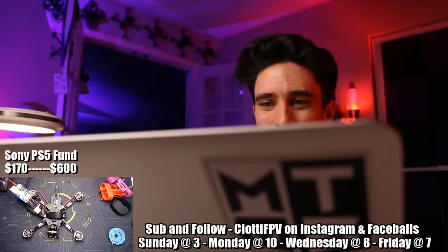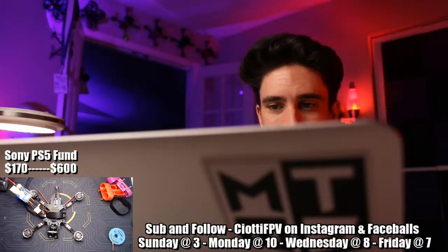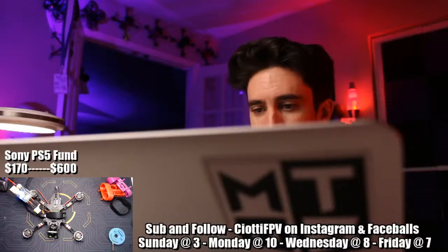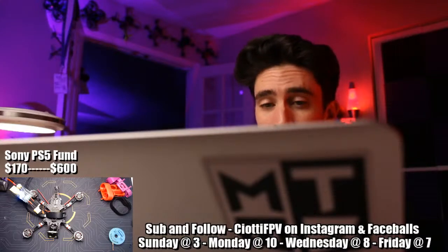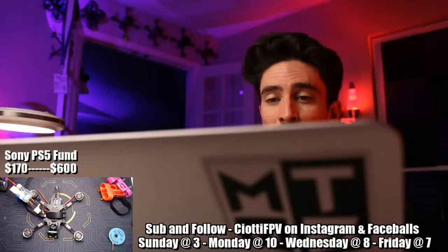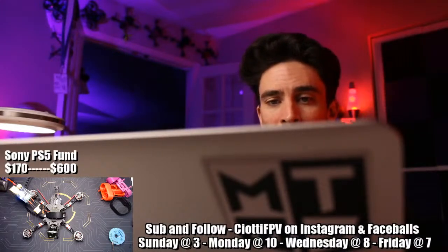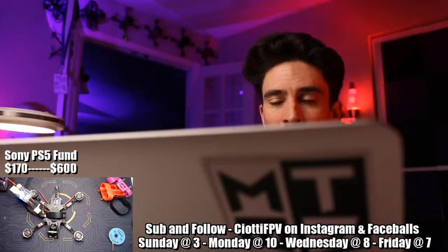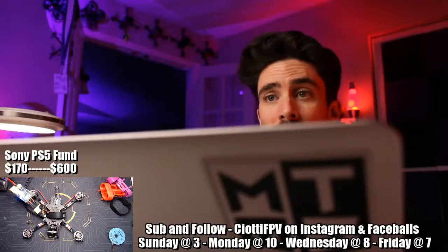Okay, here we go. So, BLS 16.7. We're going to put this on the Bluejay because we put all the things on Bluejay. Do not change the ESC. This is C-H-40. Never, never, never change that. Version, I'm going to go 0.16. PWM frequency, we're going to go 48. And flash. And now it's going to take a little bit of time.